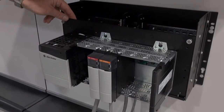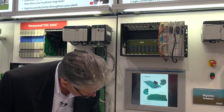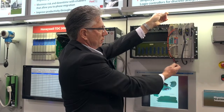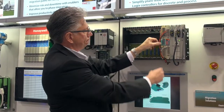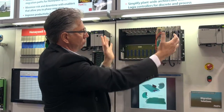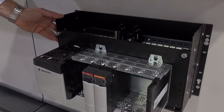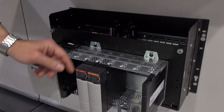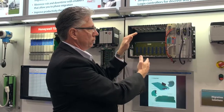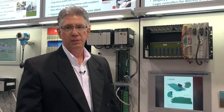I recently released this wiring solution here, where you can take the I/O out very quickly by unmounting or taking these swing arms away from the I/O modules, pulling this rack out, placing this base module in its place, snapping two adapter modules, as you can see here, onto a DIN rail, and then cabling over to a ControlLogix I/O. It allows for very fast cutover.